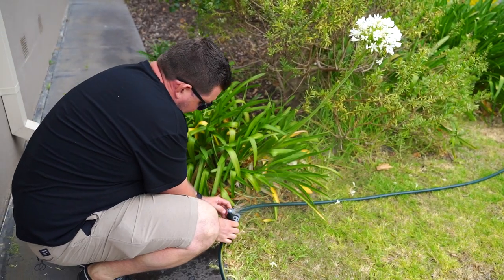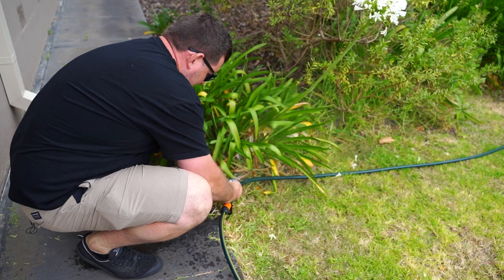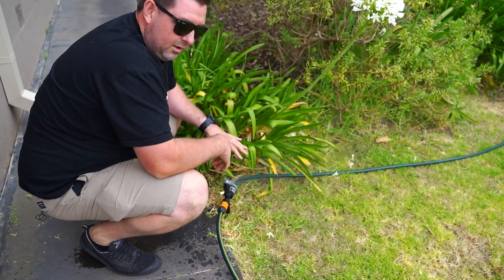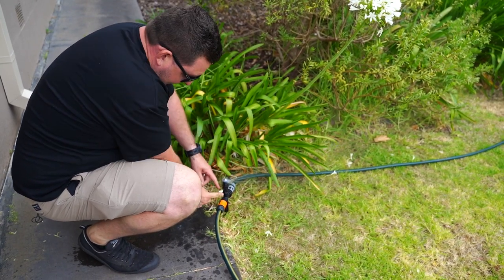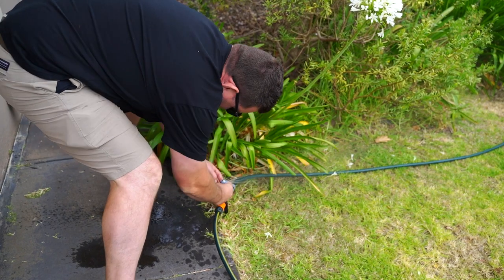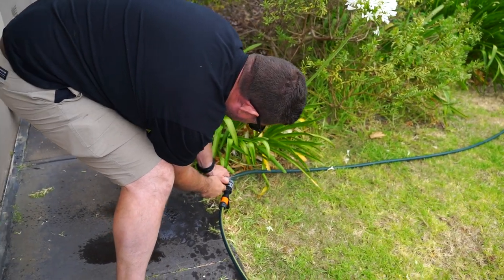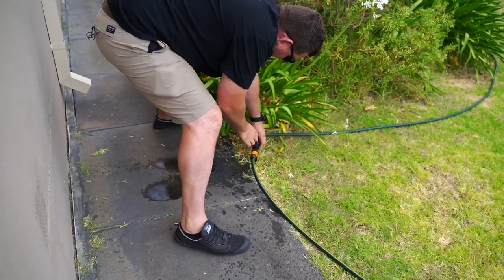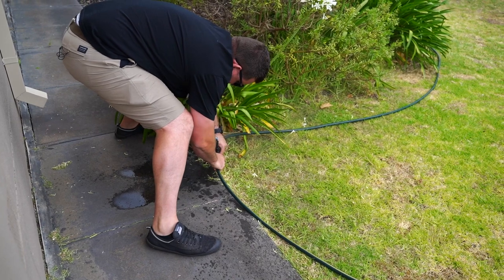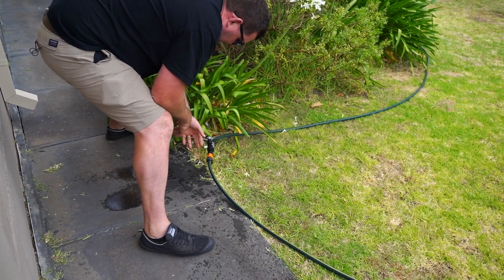The R-Van is an adjustable nozzle. That white line is the left-hand side of the sprinkler. Now, that's not tight enough — see how I'm getting wet? That there hasn't been tightened up enough. That one's not tight enough either. So if you're getting leaks, it's because they weren't tightened up enough. Now, what I'm going to do is just push down on the top of this and turn it until these are pointing down that line.